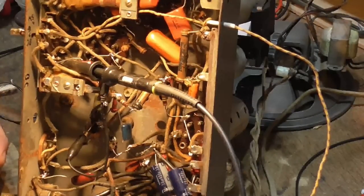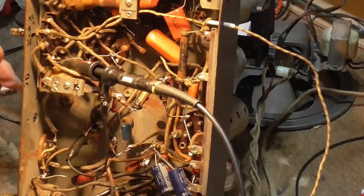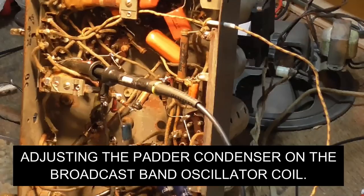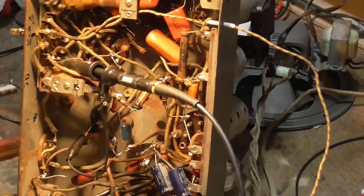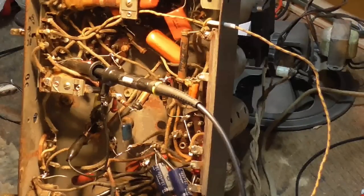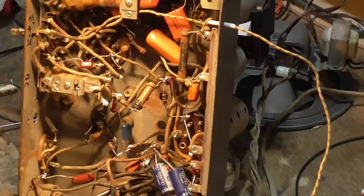All right, now on the bottom end, okay, let me go down. Let's see, trigger. Bottom end, 1.09, and we want 1.01. Surprisingly close. Okay, we want 1015. It's very close. Okay, here's the top. 2.07. We want 2.1. Okay, so it's very close. All right. The range of the oscillator now is close enough to be okay.